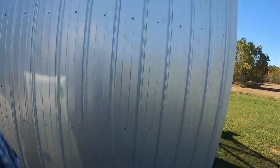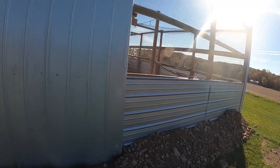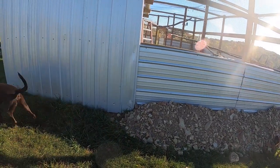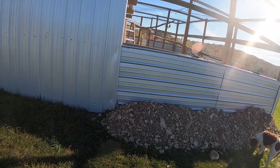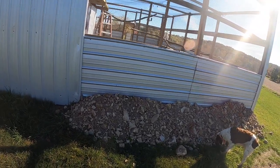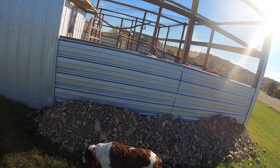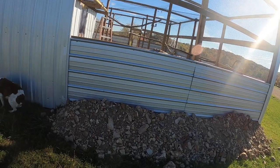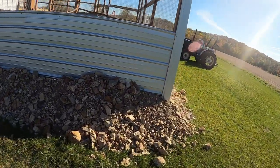So we'll walk around — this is the wall that makes the house I built for them. Because we're on a hill there was a good bit of gap underneath, so I put chicken wire in and kind of took it to an L shape once it hit the ground. I got creek rock and put a layer of it here, then I came back on top of the creek rock and covered it with a light coating of quick concrete mix. Then on top of that I've got more creek rock.